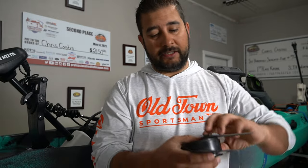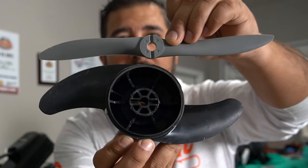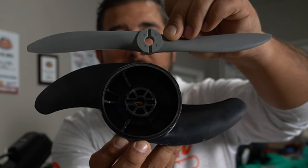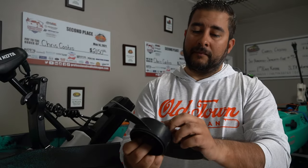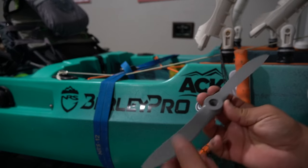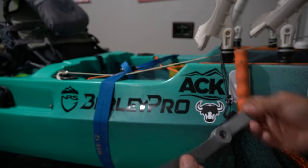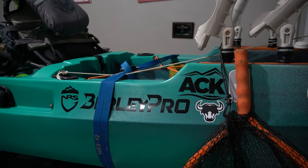Let me show you something. It actually so happens that if you look right in the middle, you'll see it has the same molding for the pin — so it is a perfect fit for the Minn Kota. Now here are the challenges: when lining them up, it's a little too long, so you'll have to shave it down about half an inch — you could probably start at a quarter inch. You can do this a couple different ways: you can literally snip them, get a piece of sandpaper, or use a dremel.